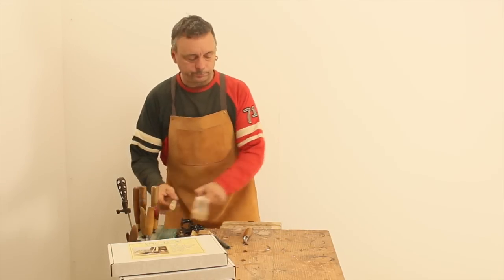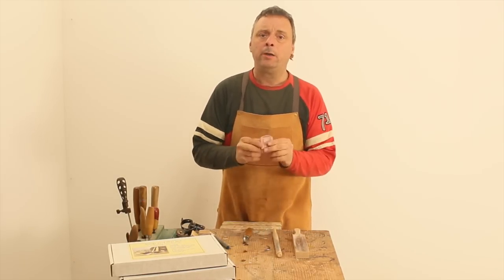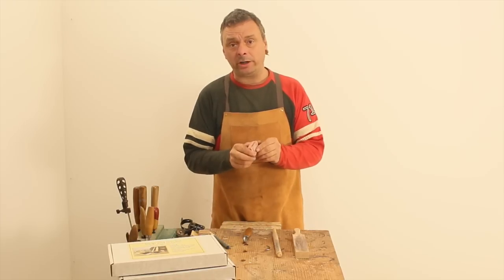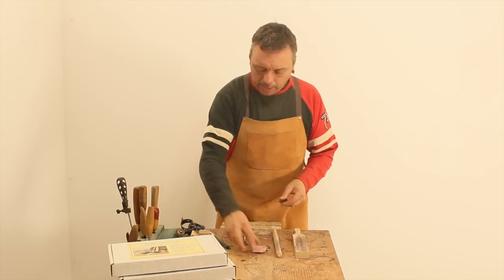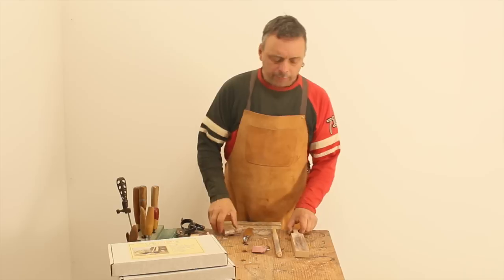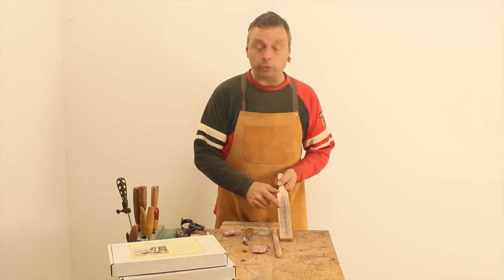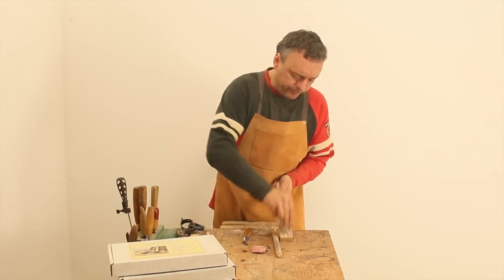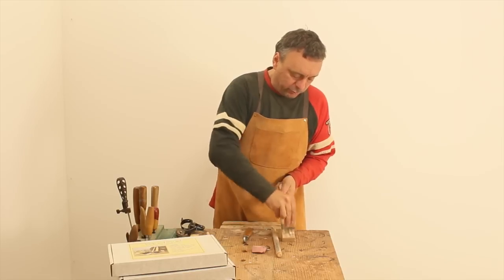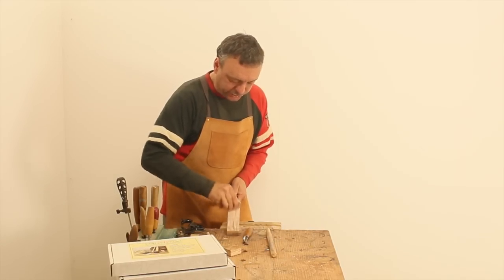The strops. Got 2 strops. The polishing compound, which is a very fine metal polishing compound, and it will work on very hard steels as well, stainless steel, alloyed steels, etc. And we have a little scraper. Very often there's a waxy build-up of metal and compound on your strop, so I need to take this off every now and again. I don't do this every time, revealing fresh leather, and then I just apply the compound, put plenty on, make sure you work all over it.